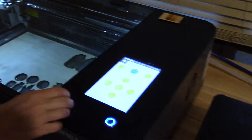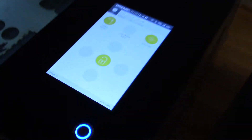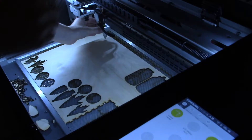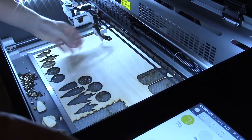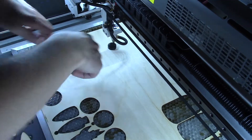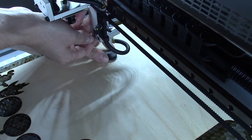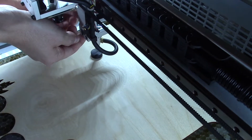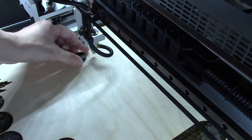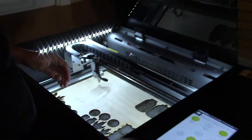I don't push the material all the way into the corner because it allows me to engrave all the way to the edge — the laser needs a little extra space on either side as it's engraving. To laser cut properly we have to adjust the z-depth so the laser can focus on the top of the material. I unlock the gantry, use the little puck that came with it, adjust the laser head with a manual screw, and then lock it back in.